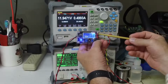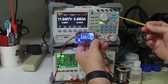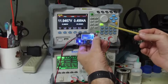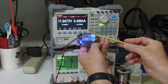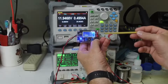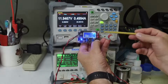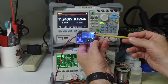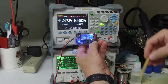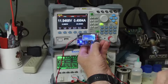There are 4 different modes of operation of the LCD. They can be accessed by hitting the set button. F0 monitors the output voltage. F1 monitors the input voltage. F2 will alternate between the input and output voltage. F3 selects the USB output. And this display is blinking right now to warn you that you are going to enable 12 volts to come out the USB connection, which would typically not be normal and possibly be dangerous.